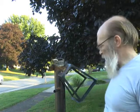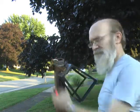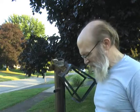Now, if you notice, I took those wire caps off very, very carefully, even though I checked to be sure that the power is off to this. You always double check, okay? There's been times where myself and many other electricians thought we had power off to it, and we actually sort of did, but what we found out is somebody did some creative wiring and there was power being delivered by another circuit or another branch. So I like breathing and heart pumping.